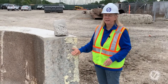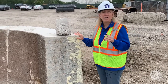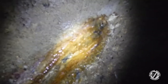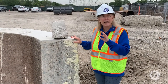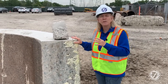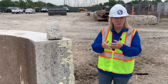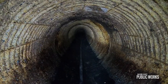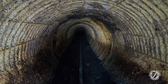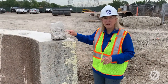It's an amazing pipe, but you have to maintain it. As I talked about, we have weepers and gushers and voids in the pipe because of degradation. A lot of different things happen inside — one of them is what we call H2S. Because of the consistency of the flow in there, it creates hydrogen sulfide. If you're ever walking over a manhole and you smell sewer odor, that's H2S. It's very high acidity and it just keeps eating away at the pipe. You can see how rough it is on the inside.